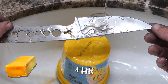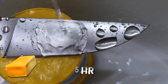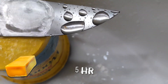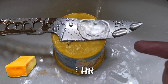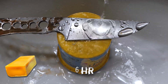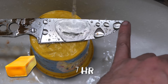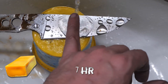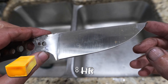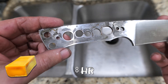Flipping it up to look — there is some rust starting in the standing water. At five hours we're starting to get a few spots of rust. At seven hours we've got some spots that are growing, new spots appearing, and oxidation under the main drip is now evident. At eight hours I tapped it out — there are lots of little spots everywhere and the backside looks pretty rough too. But overall, I think the carnauba wax did pretty well.